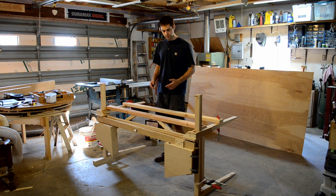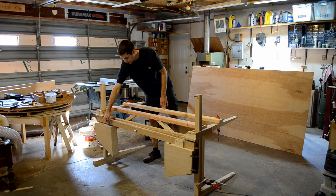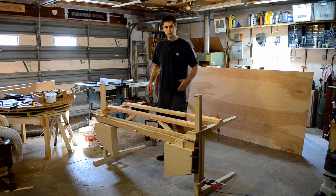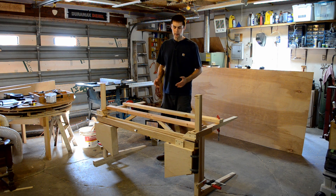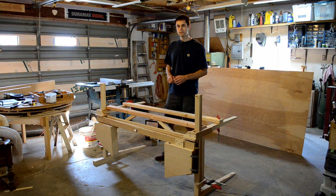The problem with sand is that it's not that dense. This counterweight weighed about 22 pounds and wasn't enough to offset what we're going to have here, so we bumped it up to 32 pounds. If it's not mounted in the center, it starts twisting the arm, and in order to mount it in the center for the inside arm, the arm has to come out from the frame, putting more leverage on the bolt. We need more weight. Steel is obviously ideal — it's 7.5 to 7.6 times the density of water — but not everybody has plate steel sitting around, and it can be hard to work with. Concrete is about 150 pounds per cubic foot, 2.5 times the density of water, but it's still not enough. Sand is in the 120 range. Steel is kind of a requirement.